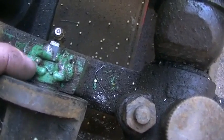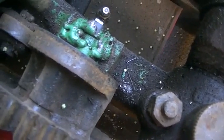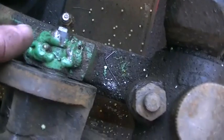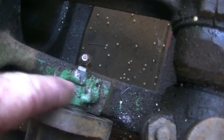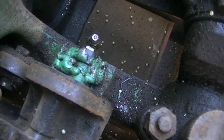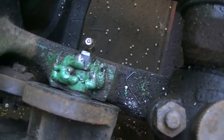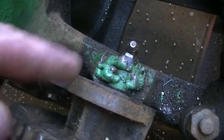It's going to be a bit tricky because some clown, rather than fix it properly, has just decided to weld the carrier shaft for our valve gear straight onto the block. So we're going to be ripping that apart, grinding it all down, and making up a new carrier for it so we can remove it when we need to — because at the moment we cannot remove it. It's all been welded on, and not very good welding at all.